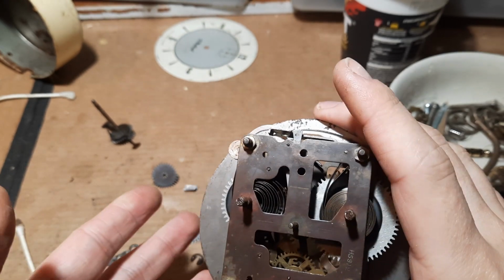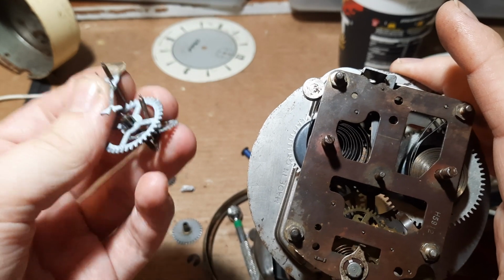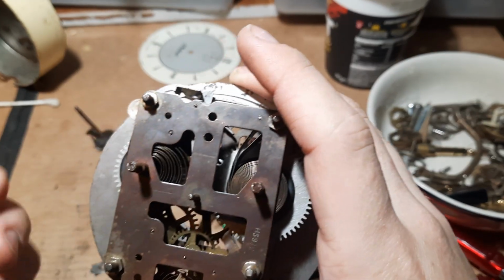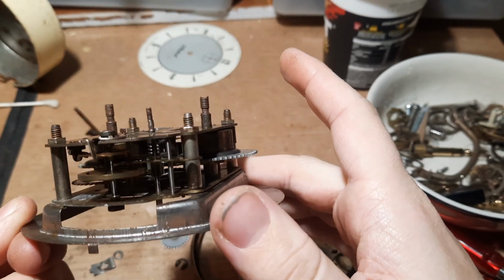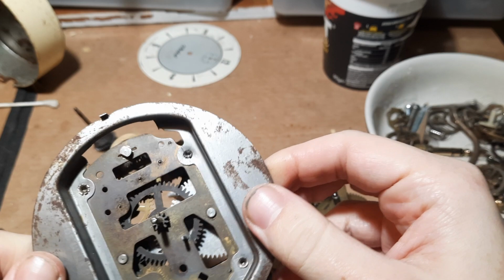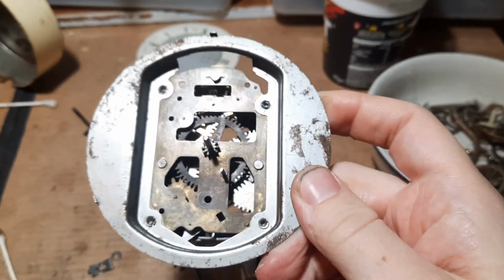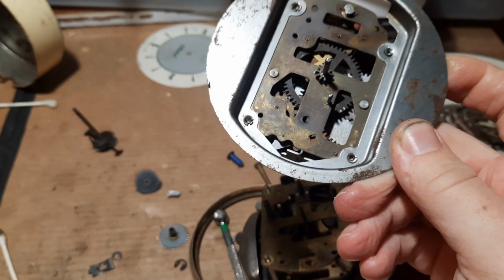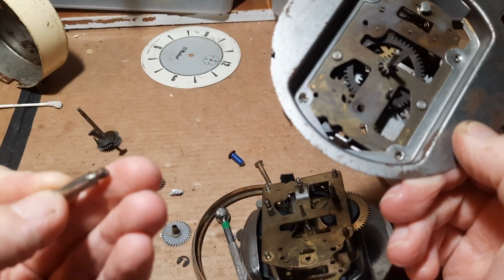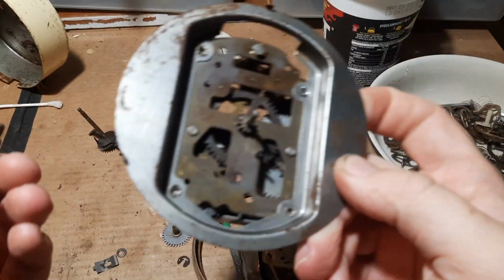And if they're the same part, these are pieces which, being corrosive, will be detrimental to the actual running of the clock. And they're the same. I'm going to swap those out. Something I also swapped out was this pillar here. I don't really usually take pillars out, but as you can see, I crushed the riveted head of the other one. Where is the old? Yeah, this is it, because it's got that notched out thing that I filed off to get the nut off originally. Not very smart.